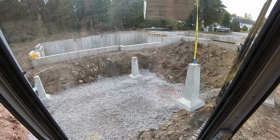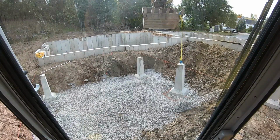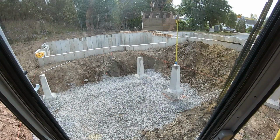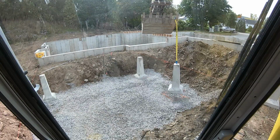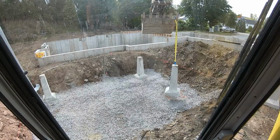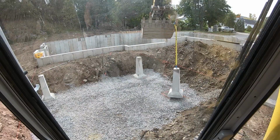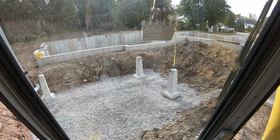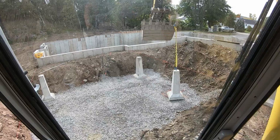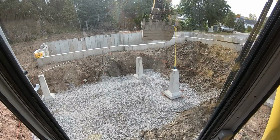If you were down that low, but the strap's long enough. But you always want to maximize your reach by being on the right side of the tooth. But always keep that bucket all the way curled like I am right now. Max it right out, because you don't want that to slip off. We're gonna get it down nice and low. Guide her into that orange box. And when she starts to slow down, lower.